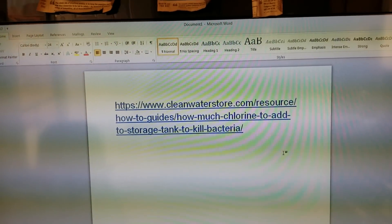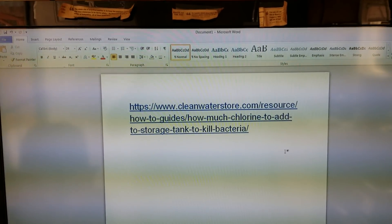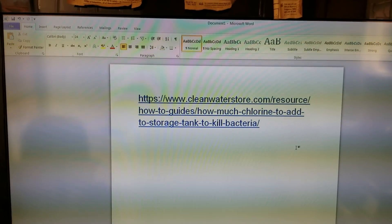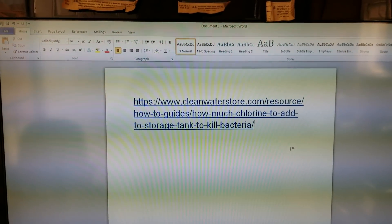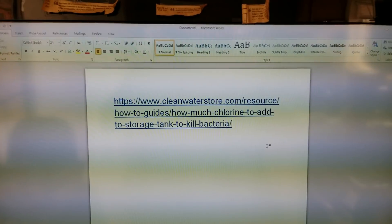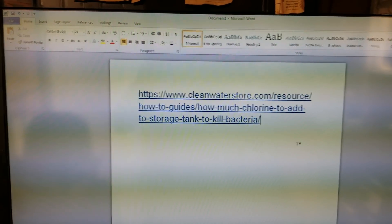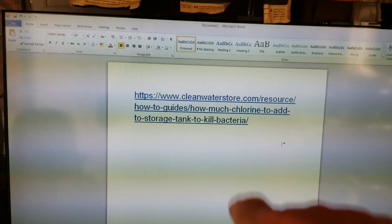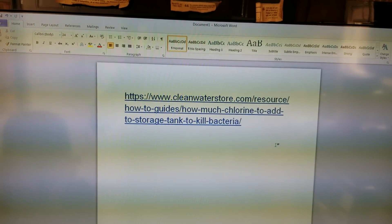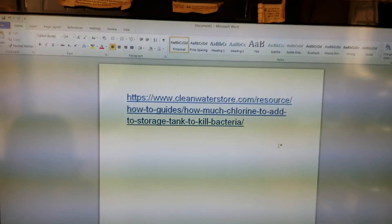Now, the chlorination — he asked if I used bleach or pool chlorine, and you can use either one. Just make sure that if you're using bleach, it's not one that has additives in it, like fragrances and soaps. You want just straight chlorine bleach. The problem with using regular chlorine bleach is you have to use twice as much of it as pool chlorine. So when reading the chart on the website, make sure you're reading the figures for regular household bleach — you'll use half that amount if you're using swimming pool chlorine.